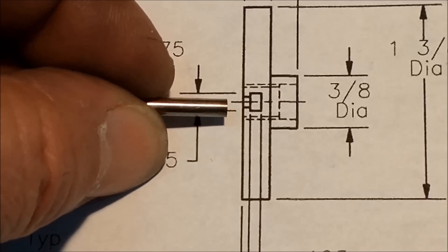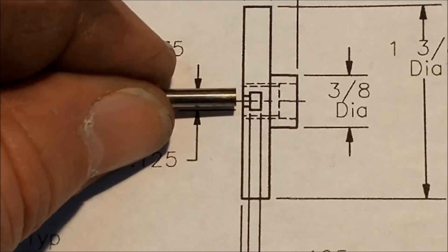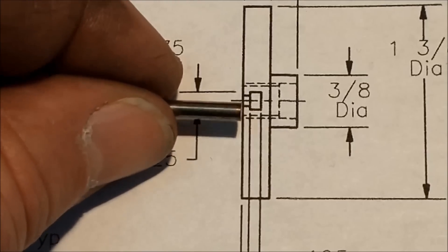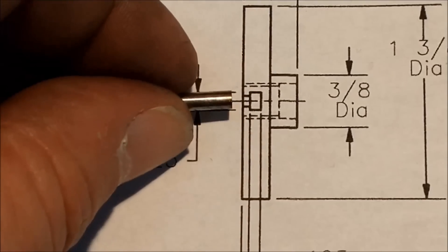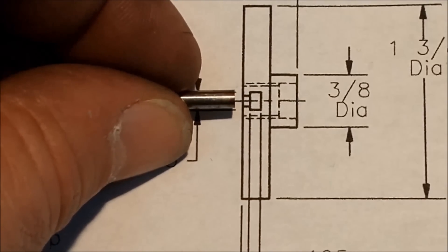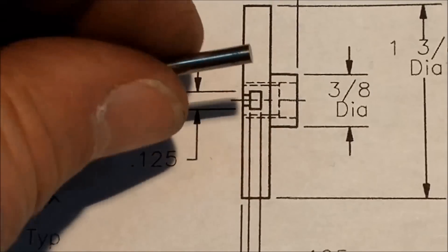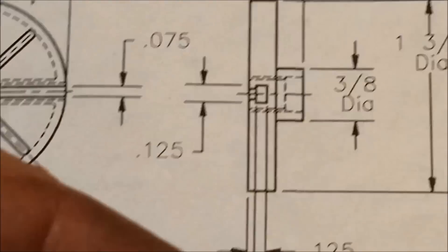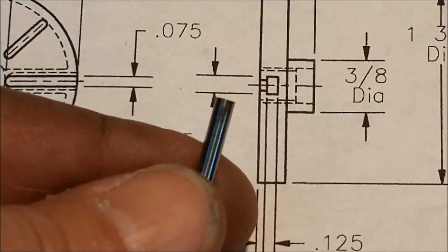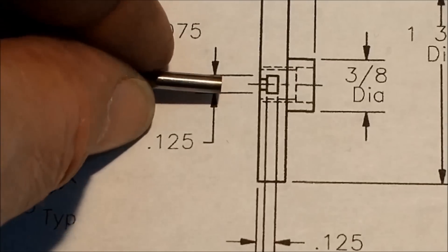To be honest, I was going to do this with a cutoff wheel, but the cutoff wheels I have are just too soft and continue to break down, not giving me the sharp corners I was looking for inside. So I'm going to do this in a rather unconventional way and I don't even know if it's going to work right now. But I know carbide cuts high speed steel, so let's put this in a 5C spin indexer and do this form tool in the mill. Keep fingers crossed — I think this is probably going to cost me an end mill or two. Let's see what happens.